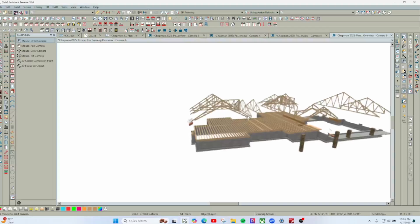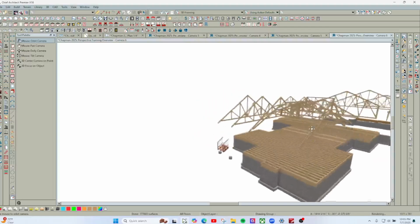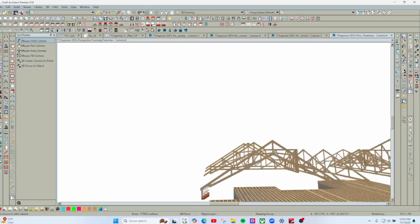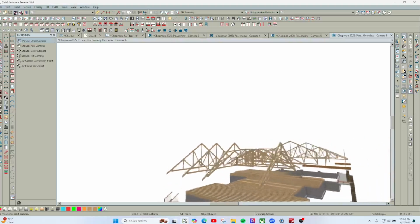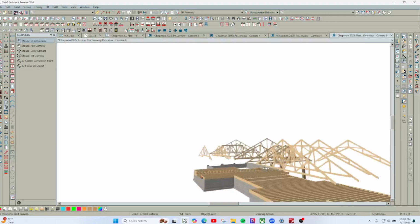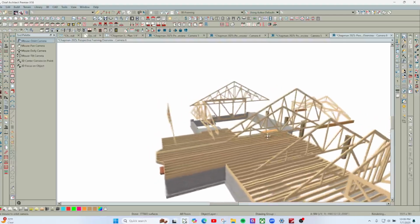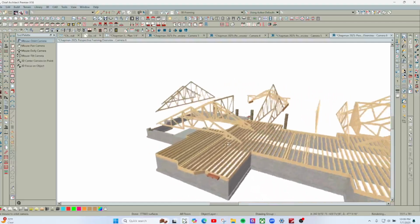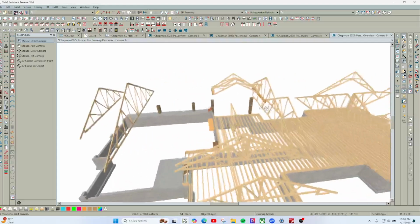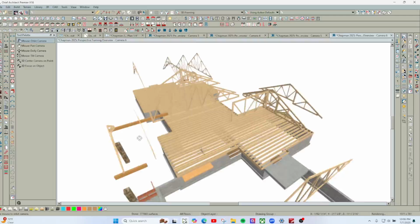So this would be our standard truss for the great room. It'd be a scissor truss. These aren't as expensive as what we talked about, the 8-12 on the end. This is 6 on the end, 8 on the out. Then in the kitchen, we'll just have a standard 6-12 across there. The front to back right now are just 28 footers. And then when we get into the master bedroom, we'll have this 26 foot with the tray in the master. Depending on what we do up front, over the entryway, you'll have these scissor trusses like this.